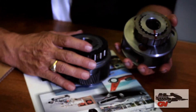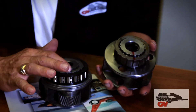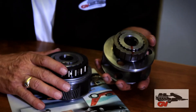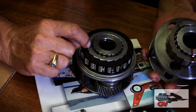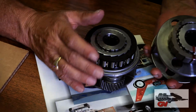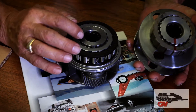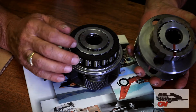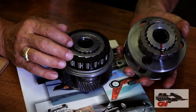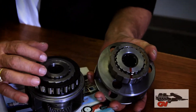Pro mod cars require the ultimate strength in this area. During manufacturing, some parts can only be assembled by cooling the inner piece and heating the outer so the dimensions open up enough to fit together — a whole other process of making really close tolerances.